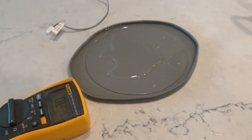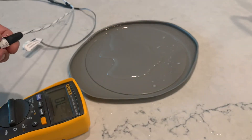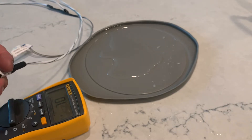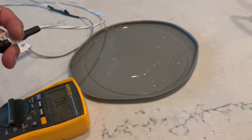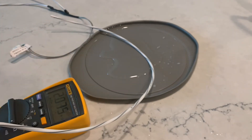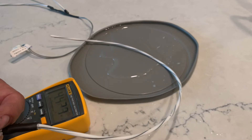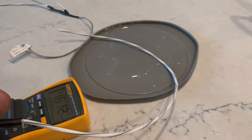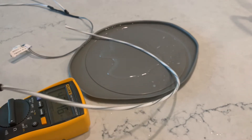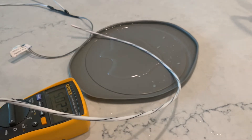Let's try the lower sensor on the hybrid unit. Here we have ports one and two up top — open. Simulate some water on the ground — immediately look at that. I think some of the literature states about 15 seconds or so, but that certainly wasn't 15 seconds. This is almost immediate. So it should notify you if you start to leak water or the condensate gets too high — or at least it'll notify the water heater.